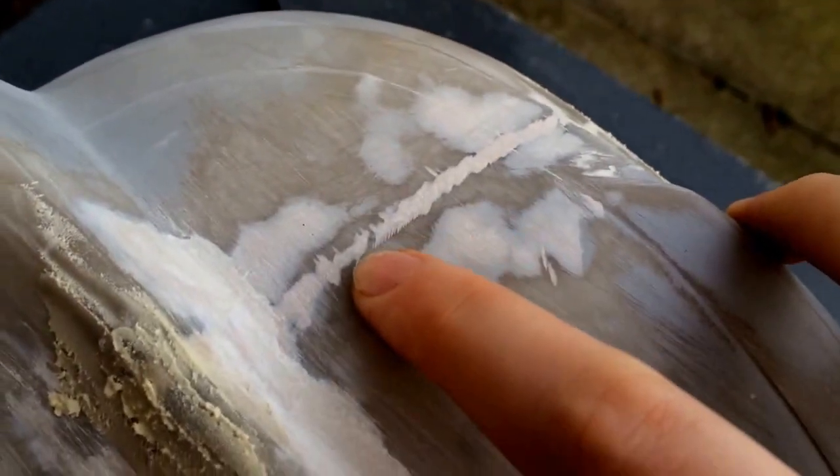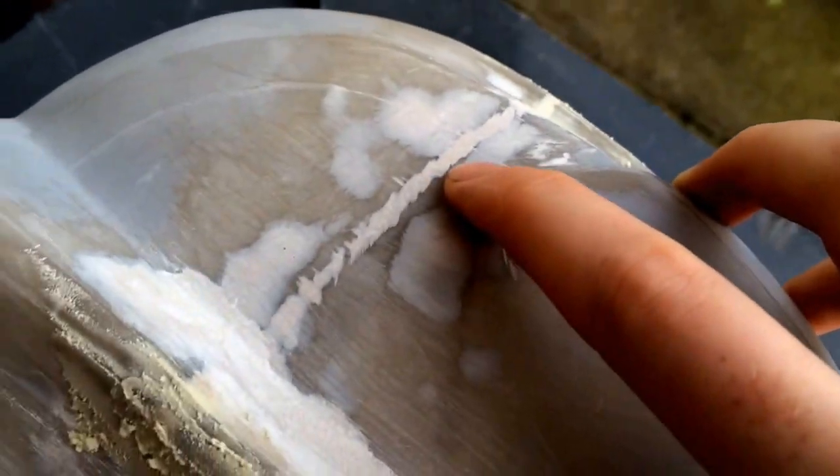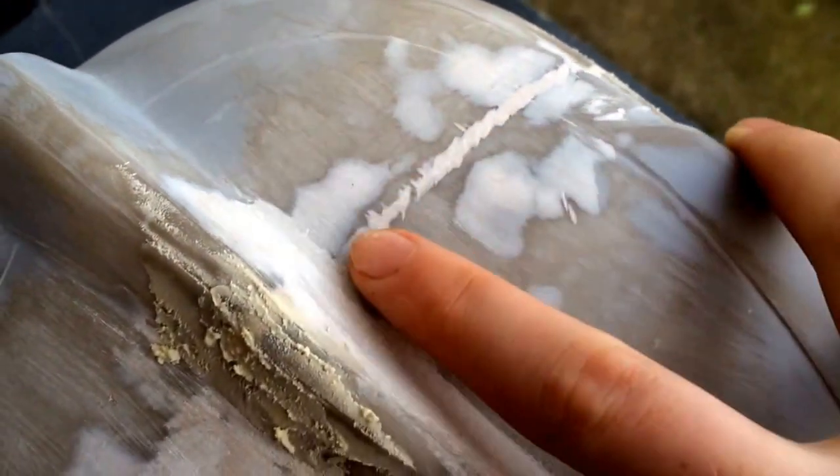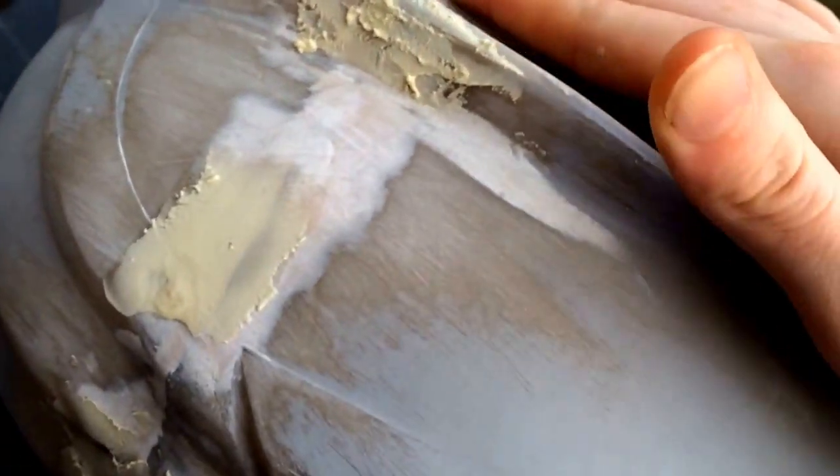So what you do — if you've seen these kits — is Eric's kits come with a seam that goes all the way around it. You can sort of see it there guys. That's been just filled in a wee bit here. This one here has been filled in actually quite nicely — you just get a small seam that's just a wee bit rough, and you just put the filler on and then sand it down so it's level on either side. That's actually turned out nice.